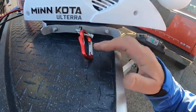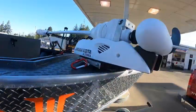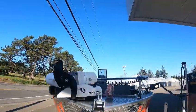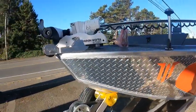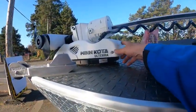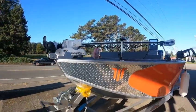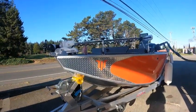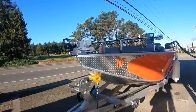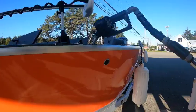If you needed to get this thing off, you can just pull this — this thing comes off and pulls out over here, and then this whole thing comes out. Don't let those two bolts fool you — just pull that and this whole thing lifts. This is a self-deploy — everybody's going to these. There's a remote control I'll program when I'm out there. You've got to program your puck once, and then you're done — just push the button. These will not spin unless they're deployed. You've got to have the power on; it powers up but nothing will spin until it's deployed. The deploying and stowing is the most important — get that right and the rest is easy. Don't go into a heavy current like a 7 mph current and lift the motor — better to spin the boat around and use the current to help lift the motor.